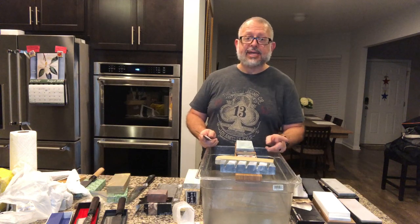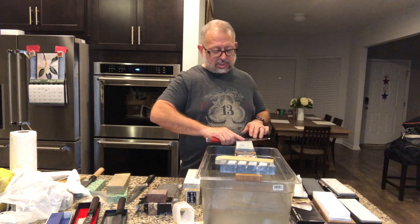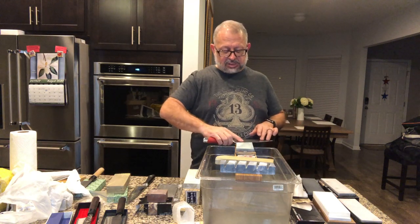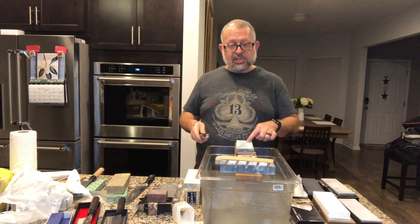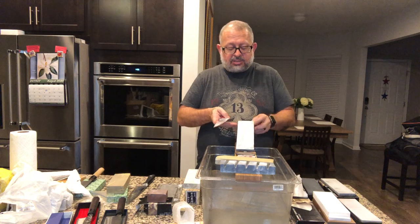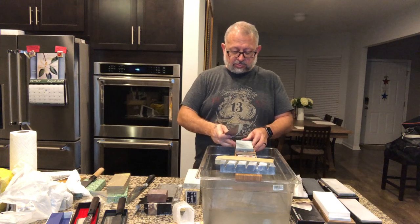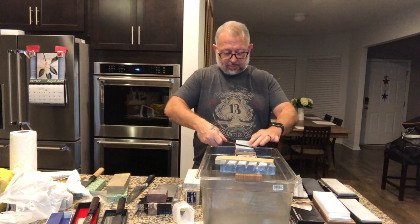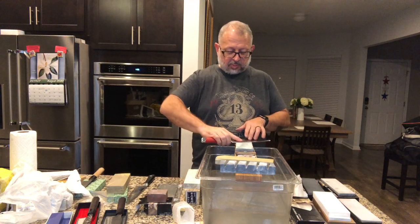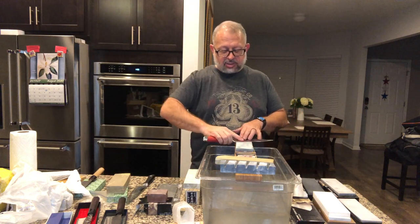So I tell you what, we're going to go to 8, but we're not going to get off the 8 before we do edge leading strokes. So again, pushing forward, pulling towards myself. What's nice is, if there's any type of burr that you've created, you literally see it. There's a line here and a line there that shows me metal still coming off the edge. Make sure your pressure is the same all the way across.